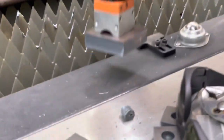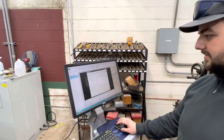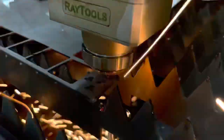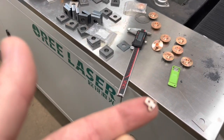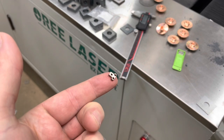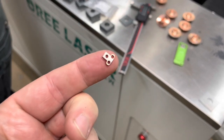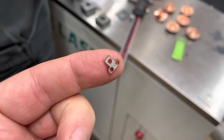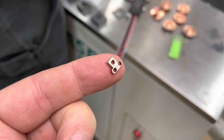I was there for four days, and while I was there they already had orders coming in. They had gotten an order to make 200 of these little master links for some kind of tiny chain, to be cut out of 090 stainless. We didn't have the 090 stainless but were trying to get a feel for it — those are 078 holes. It cut pretty nice and was going to need a little tumbling. If you're new to lasers, you can get really beautiful burr-free cuts with most materials and most shape sizes, but when you get down to super tiny stuff in thicker material — say thicker than 18 gauge — you will get a little bit of burr on there that you've got to deal with.